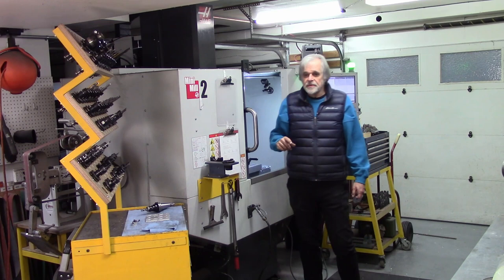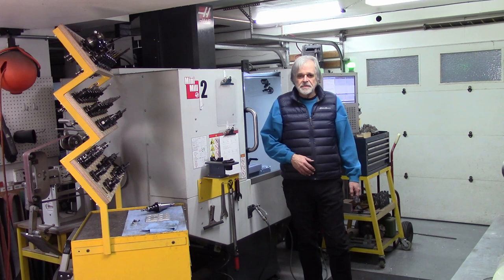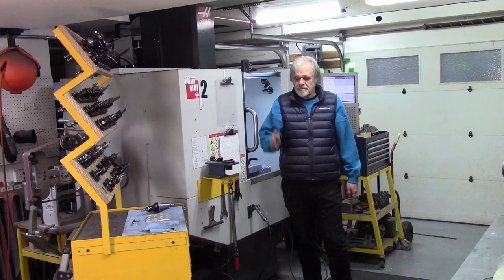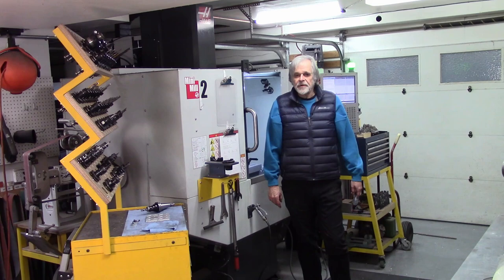This is the problem that I kind of talked about a little bit before, where in the Haas MiniMill, the carousel, what they call the umbrella tool carousel, has 20 positions, and they assume that you're going to have tool one in position 1, 2, 3, 4, etc. I have almost 60 tools, and 20 tool holders is not going to be sufficient for me. And because the tool change is pretty slow, I like to have them sequenced in the order that they're used. So the order might be, you know, tool 15, 27, 3. And so I could never have the number in the tool holder equal the number of the tool that corresponds to its length offset in the offset table. So I wrote a custom program, figured it out, works perfectly.